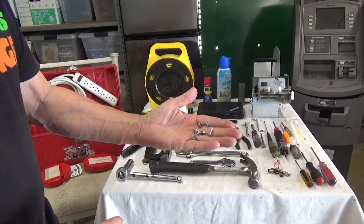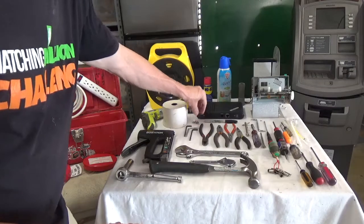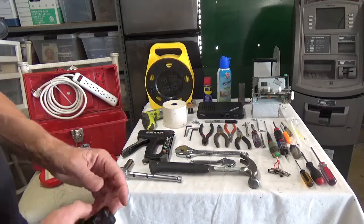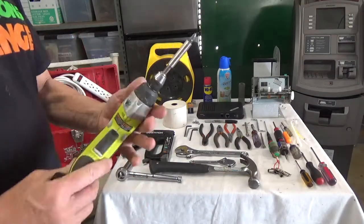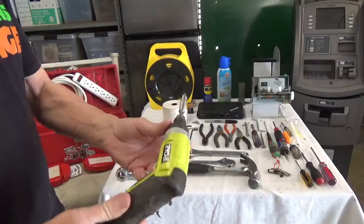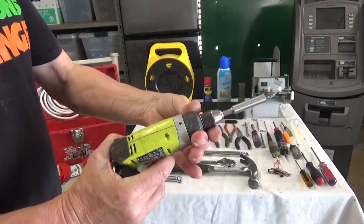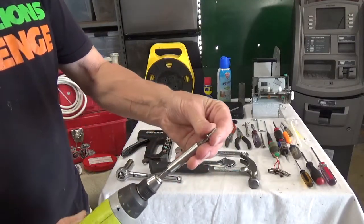Keep a little bag of miscellaneous screws in different sizes — you never know when you'll lose one. Also keep a couple of quarters in the bottom of your toolbox for parking meters — you don't want a $78 ticket in Los Angeles. Next, a small electric drill like this Ryobi is very useful. It has a ratchet system so you can control torque — important when drilling into plastic bezels, so you don't strip threads or rip through plastic.